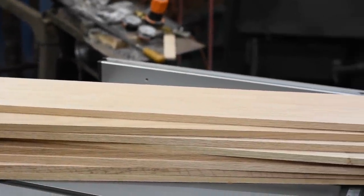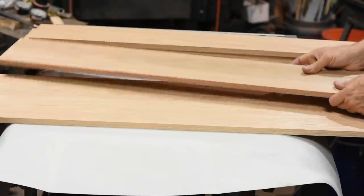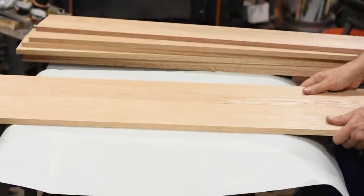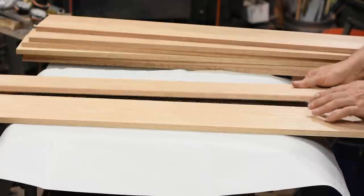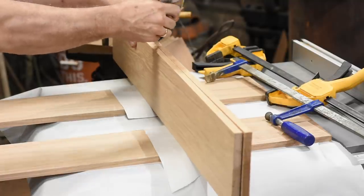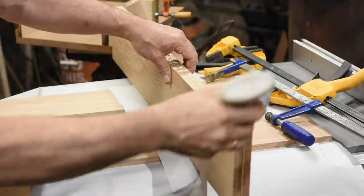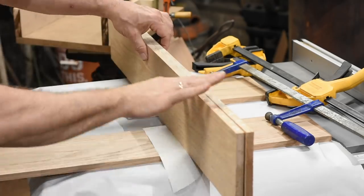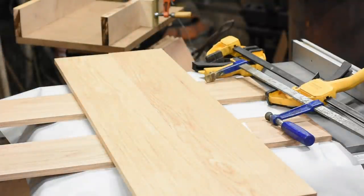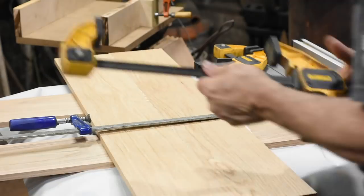The project was made mostly from half-inch oak boards that I purchased from Home Depot or Lowe's — I can't even remember which. I did no planing or joining; I just spent a bunch of time sorting through the bin for the straightest lumber so I didn't end up with any warped or twisted wood. I'll begin by gluing up the panels for the sides. With a project like this you're generally better off using glued sections rather than cutting slabs to shape, especially with really thin lumber — there's less chance of warping and twisting than with a big old piece.